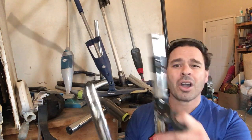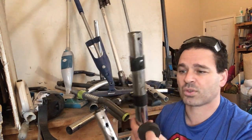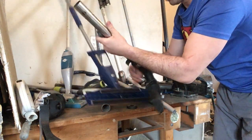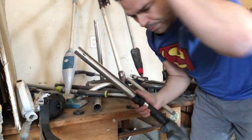It all depends on how much you have. You can get fridge doors, microwave outer panels — different appliances will have the stainless steel look that is magnetic. There is a category for magnetic stainless steel at some scrapyards, so definitely want to check with your scrapyard. But moment of truth — I'm going to do the spark test right here. Here is another one — this is part of the power head as well. This one is non-magnetic, so I'm going to hit a couple with the grinder.